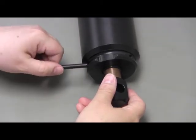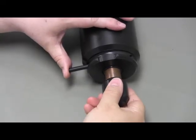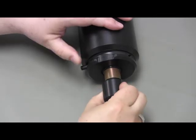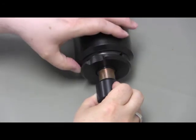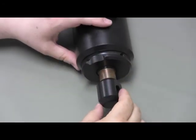Slide the retaining pin back into its hole until it stops. Continue to apply some pressure to the end of the pin while you turn the lug counterclockwise. When the pin begins to slide farther into its hole, stop turning the lug. Center the pin so neither end is protruding out of the VR2AR case.